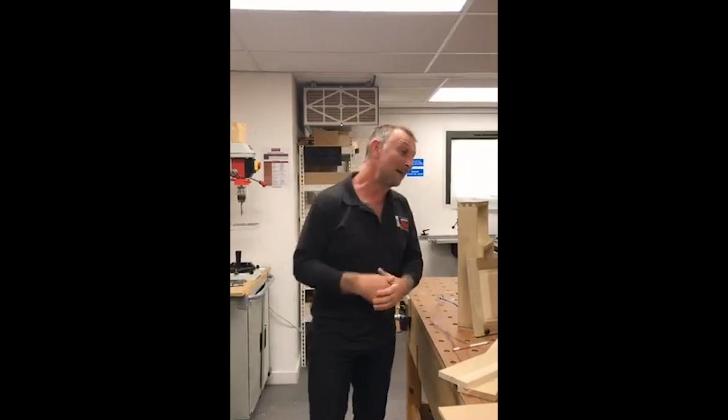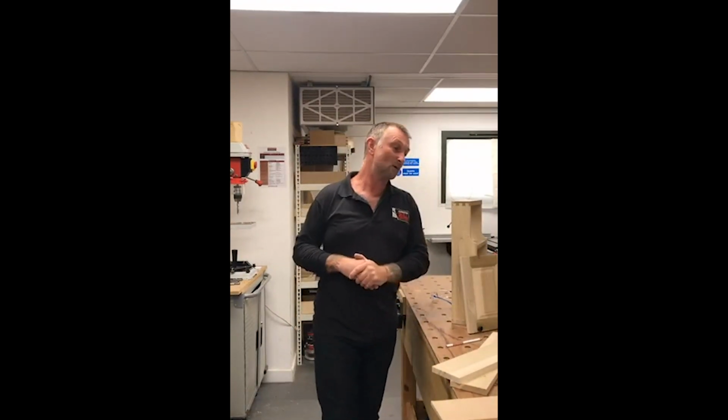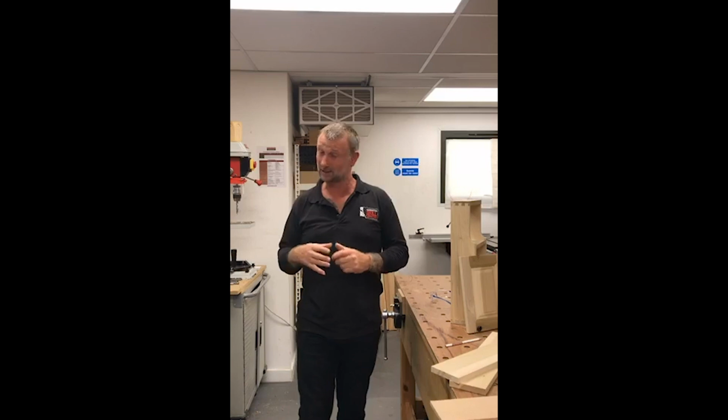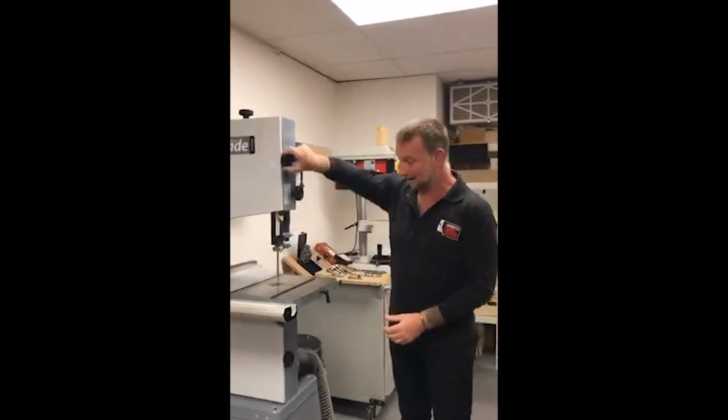Yeah, so we've got a bandsaw question from Creative Construction. My blade is properly tensioned, so why does it keep coming off the bottom wheel? The most common cause for this is a little bit too much tension, and it's really pulling tight and it pops off that bottom wheel.